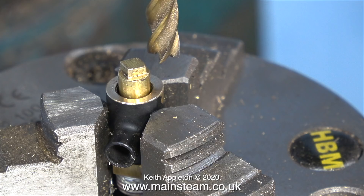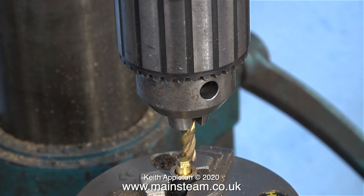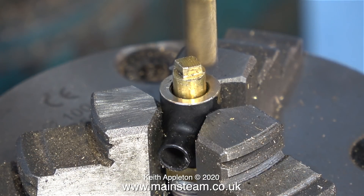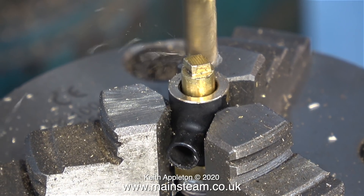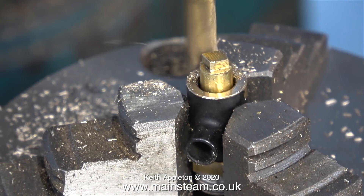You will notice that I'm using an end mill for this, not a slot drill — using a slot drill would be a bit aggressive for such a small shaft. And I am using an ordinary chuck to hold the end mill, which you normally mustn't do. On screen is an old, very good quality chuck fitted into an R8 taper. I bought this off eBay about 10 years ago and used it for a lot of years for all my milling operations. But once I started making videos I got so sick of comments from armchair engineers that I now have an R8 collet set. In this case I used the chuck because it was already in the milling machine from drilling all the holes around the smokebox, and it seems to be working fine.